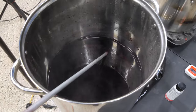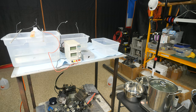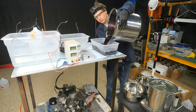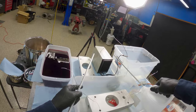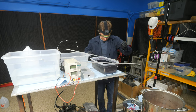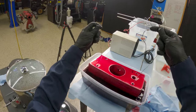It's been a little over an hour, we're still at 1.45 amps. I'm going to pull it out and go to the dye, then go to our nickel acetate. Power supply off. The dye is at 140 degrees. Into the dye — oh, looks like Kool-Aid. Rinse the acid off first, then into the dye. Now we wait 10 minutes and we're going to find out if this did anything. I think it's a little red. We'll go right into the nickel acetate and that'll seal in whatever color we got.